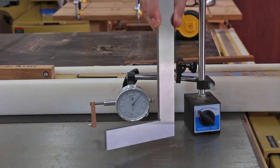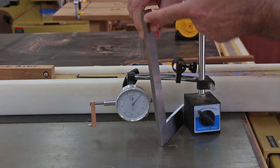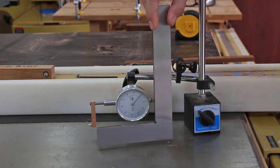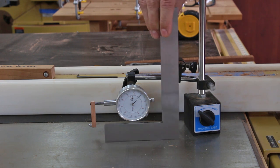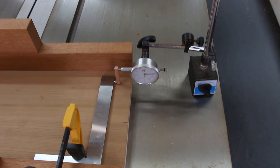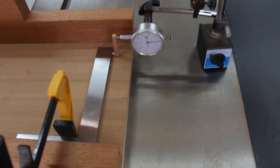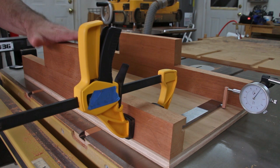Another thing you're going to need is a square with a fat edge for the stylus to ride against. This one is eight and a half inches long from end to end and they're pretty inexpensive — I'll have a link in the description if you'd like to find one. I've demonstrated this method before for aligning a fence using a dial indicator, but it's been a few years. I have my square clamped to my fence and my dial indicator with the offset bar and magnetic base off to the right-hand side of the table saw sled. It's easiest to demonstrate how this works by showing you what happens to the dial indicator needle with a misalignment of the fence.